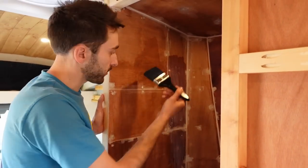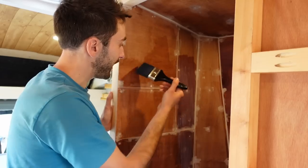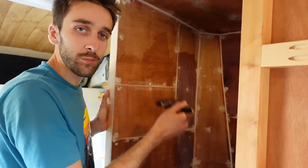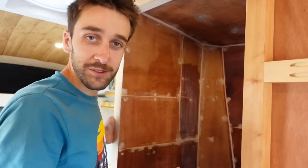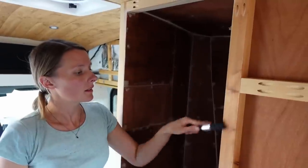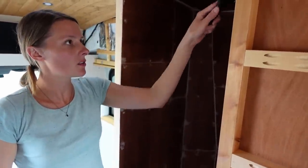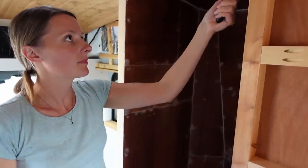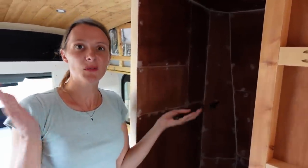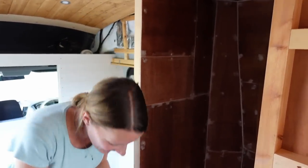So this layer, you put it onto the porous surfaces, and I think it takes some of the porosity, if that's a word, out of it so that the tanking membrane will go on better. It starts to change colour as well, so it's quite good because you can see what you've done. There we go. I think that's our first layer done, so we'll leave that to dry and do a second layer. What's quite nice is it only takes 1 hour to dry, and we've got good weather and temperature. Probably the bottom is already dry, we could just start again now.